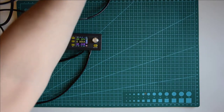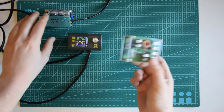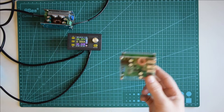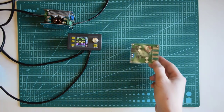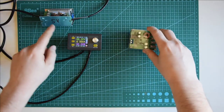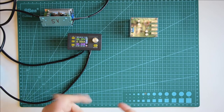I also have one of these modules that produces USB power. Both this one and the converters can take an input voltage up to 55 volts, but the solar sometimes produces up to 58 or 59 volts when on full charging, and they've worked fine with those high voltages. They can also go down really low — down to about 9 volts — without a problem. So this setup should work fine for a 12-volt, 24-volt, or 48-volt system.